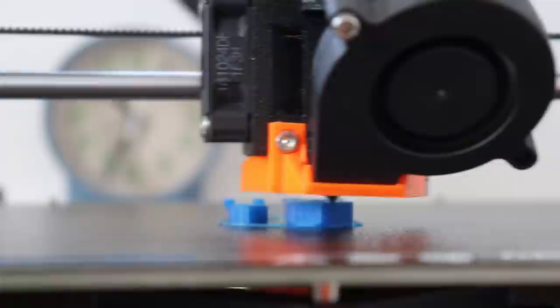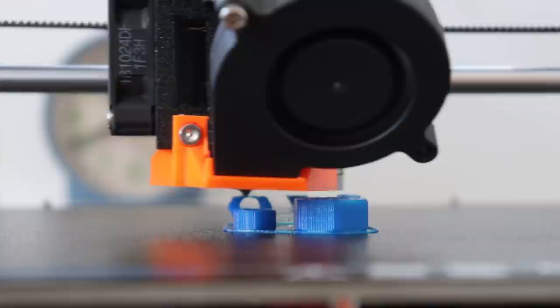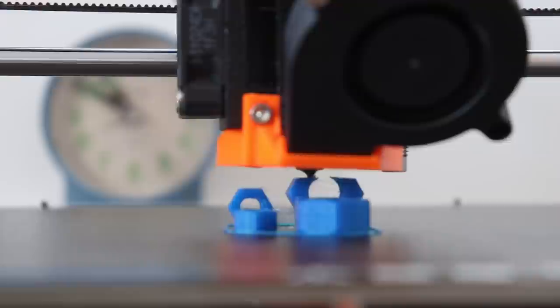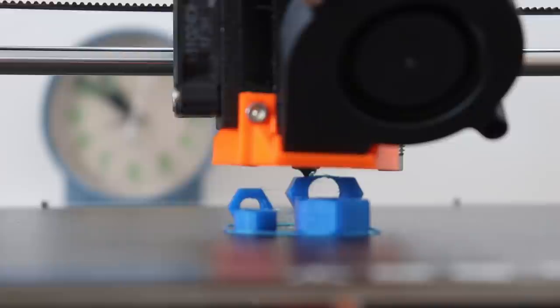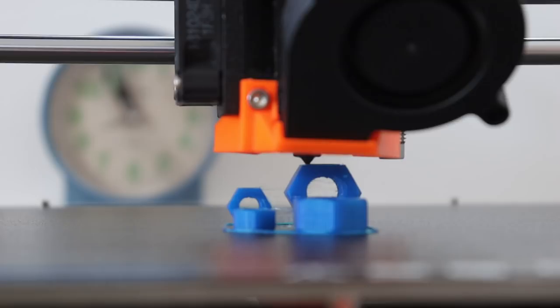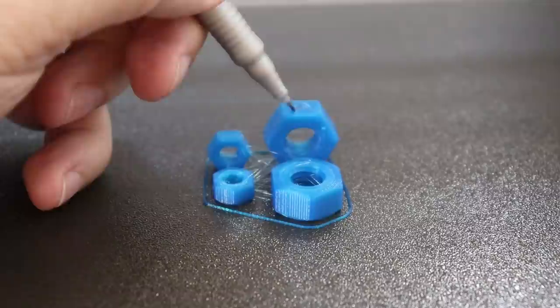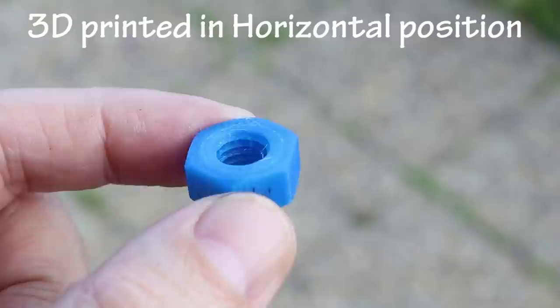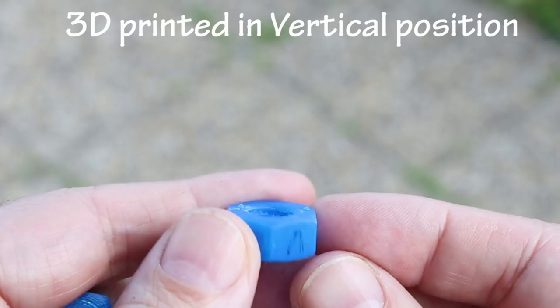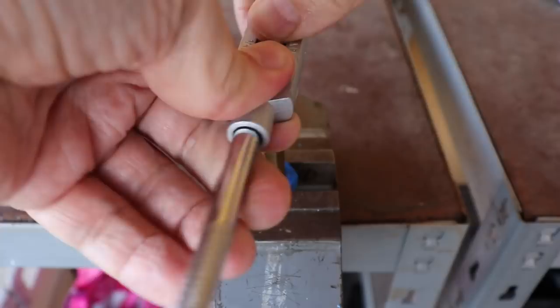Now you can see the finishing: the hole on the M6 nut was covered by bridging without any problems. Now let's see the critical points on the M10 nut printing — as I expected, this overhang is really critical and you can see it has some problems, but at the end it finished the printing properly. In my experience I can print threads up to M12 without any supports, but it really depends on your printing material and your maximum overhang angle. The nut printed in horizontal position looks really perfect straight from the 3D printer, and the one printed vertically looks okay except at the position where the hole was closed, but it can be cleaned with a metallic bolt or a tap tool.